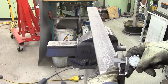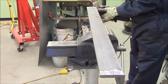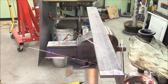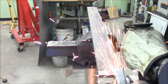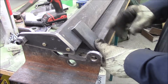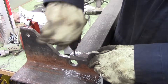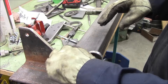This is slicing out notches, probably for the bottom of the brake. You could put this in a milling machine and cut away, but the cutoff wheel was just working so well — it does nice straight cuts. With the milling cutter I'd have to clamp it a bunch of different ways to make the shape I want, and my mill is only a 6x26 and it's just not big enough. In the time it took me to think about it, it was already done with the cutoff wheel.